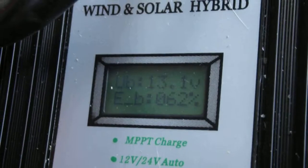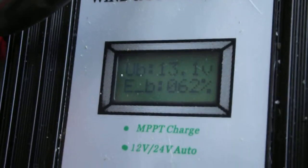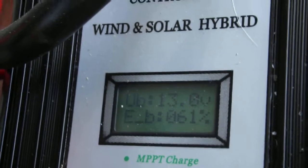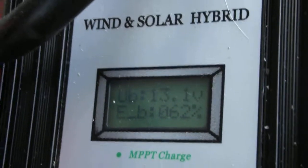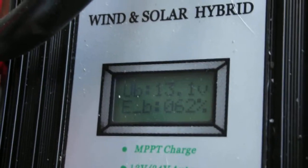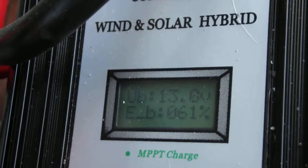The battery voltage is an interesting point. In the controller it says 13.1 volts. I've reset the float voltage to 14.5 volts, the overcharge to around 15 volts, and 14.9 volts for recovery. The battery does actually shoot up in voltage to things like 14.5 or 14.8 volts. It's currently at 61–62 percent capacity and can go up to about 83 percent, but the battery voltage drops right back down after charging ceases — it takes about 10 to 20 minutes to settle back down.